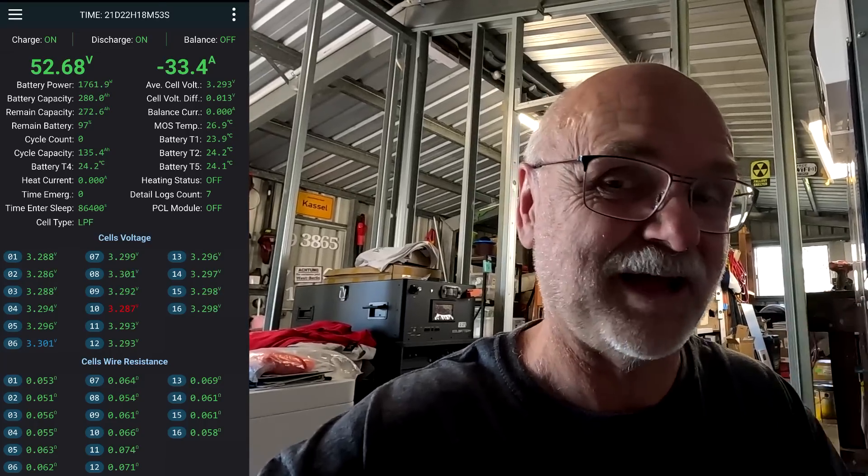So how can we discharge this battery with a constant current and not a sine wave regulated current? The only real option is to have a second battery and parallel them — one battery at maybe 20% state of charge, the other at 80-90% state of charge, so one battery charges the other with 100% DC current. Obviously this current won't be constant either, because as one battery discharges and the other charges, the current in between will decrease over time. But let's give this a try.